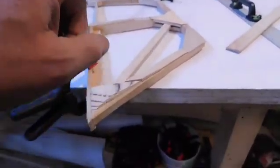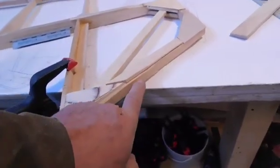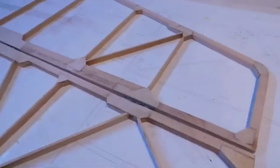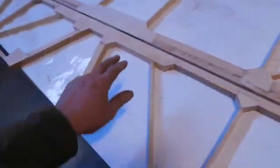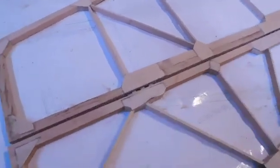So it's a nice bevel all the way down from one and a quarter down to three quarters, consistent all the way through. Again, interesting to see if on the kit you get a piece of three quarter to one and a quarter, because the plans really don't show anything for that - they just show three quarter all the way through. That's what we're working on today. We've got one of the tail planes - horizontal stabilizer and elevator - and we've got two that are basically done. I've cut the slots for the hinges and fitted them into place to see how they fit when cut to each other, and they fit good.